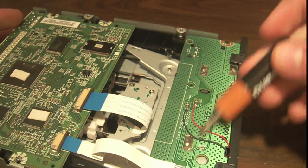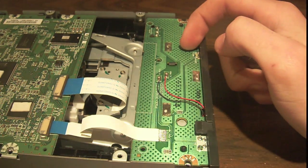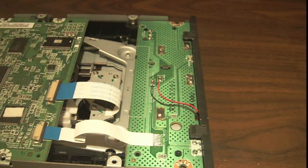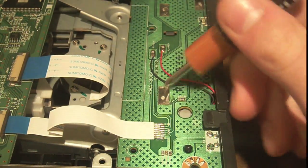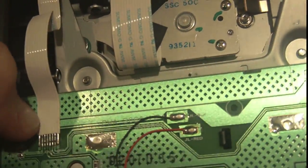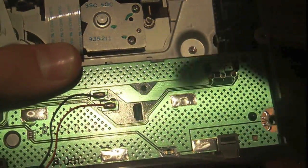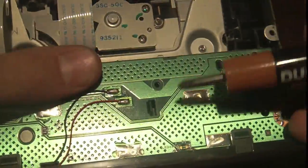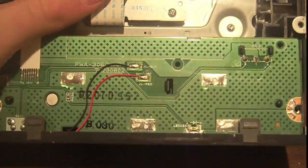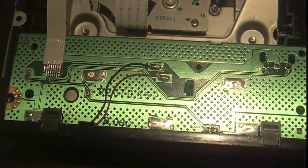So looks like up top, this board is sort of an interface board with just motor connections, and this board over here is where the actual processing is done. So this board right here, you can see there's ground planes and stuff, but these power planes actually have little diamonds cut out of them, and that's done to decrease their PCB cost, because it basically costs money to remove copper. So they keep all this copper on, basically, and they only remove tiny little bits. So this PCB, if you take a look at it, is mostly copper. That's done to save cost, and then these things are just done so that they can leave all the copper on.